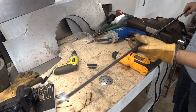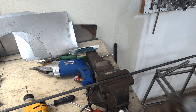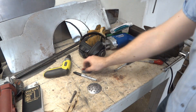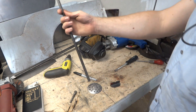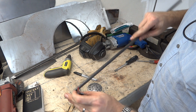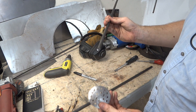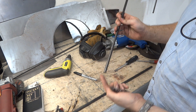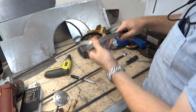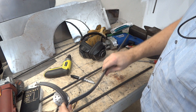Now I got to cut this — I think I'll just go with two feet each, and then I'll have two feet left over. Grinder time. Now we're pretty much good to go. Got a two foot rod, got a groove cut at an angle so this kind of sits in there nicely, which will facilitate welding I hope. Another two foot rod, I'm going to clean all these up with the grinder — the sanding disc probably. And this crucible tong cut from that single bar — weld it on about there and that'll be my tongs.